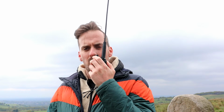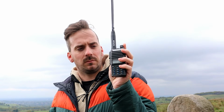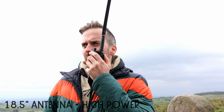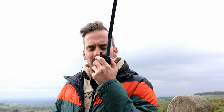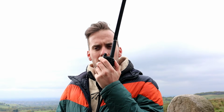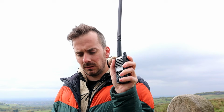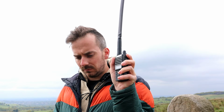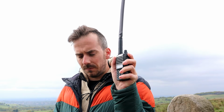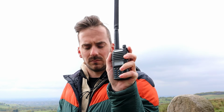Right, stand by Simon. What I'll do is I'll switch over to the 18.5 inch and I'll give you a call back on that one on high power. Okay, cheers. Okay Simon, M3HHY Mobile, we're back on the high power setting now, but with the 18.5 inch antenna. So I wonder what that's sounding like. G1 UFM, M3HHY Mobile. Would you believe, Lewis, that's exactly the same. So that's exactly the same as the other antenna on low power, using the smaller antenna on high power. Exactly the same. So all 3 results have been more or less the same.